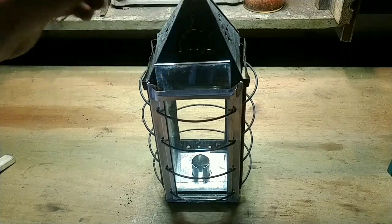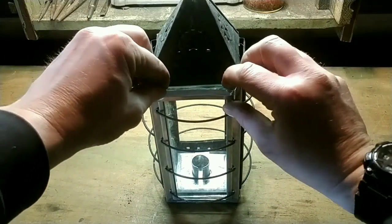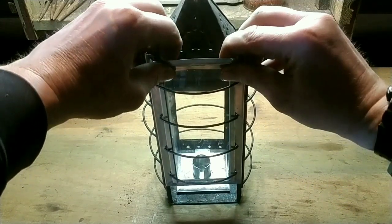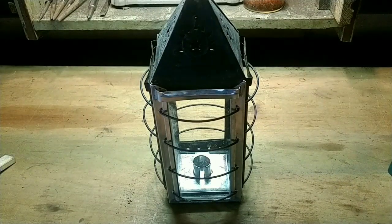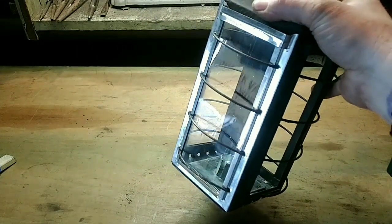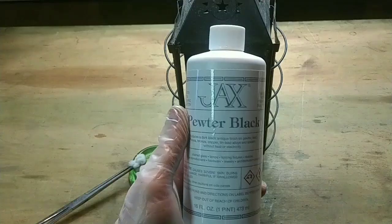This glass is a little thick in one spot. One thing about crown and cylinder glass, they are fairly uneven in thickness. They're not polished or ground down. So this glass, while it was about 2 mil throughout, had one section that was almost 1/4 inch, and that section was hanging up in the bezels.